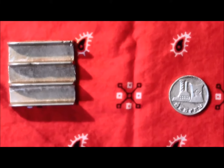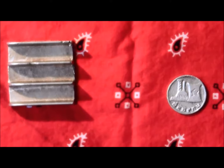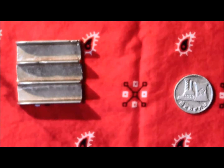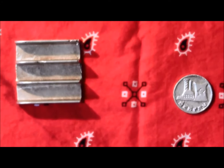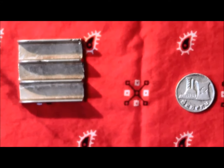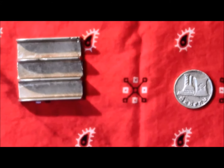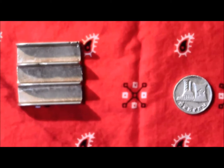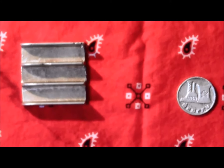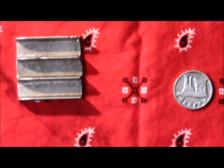Okay, now the reason why the heatsink is like that when the copper one came out so sharp is because the aluminum has a lot lower density, so there's not as much fluid pressure to push up the molten aluminum in those thinner areas. At the bottom where the coin was, there was still enough pressure to create all those details. But up near the top, there wasn't enough pressure to force the aluminum fully into those flaps. And that's one of the problems with casting with aluminum, is the lower density can be a problem.